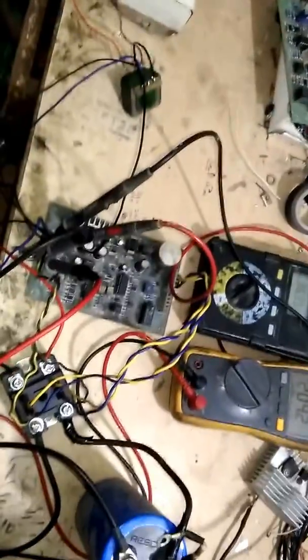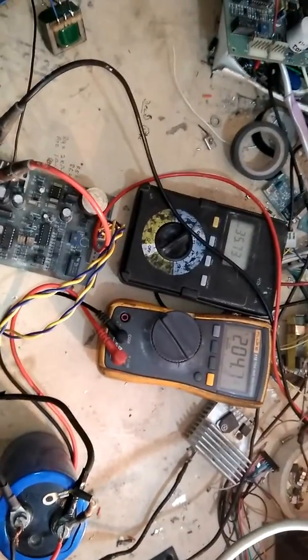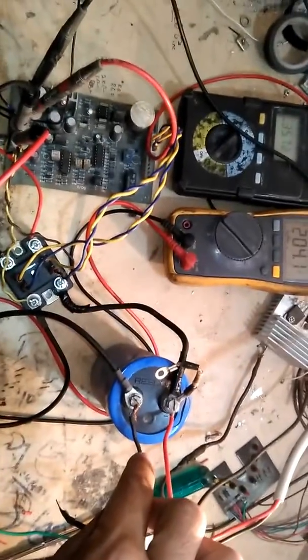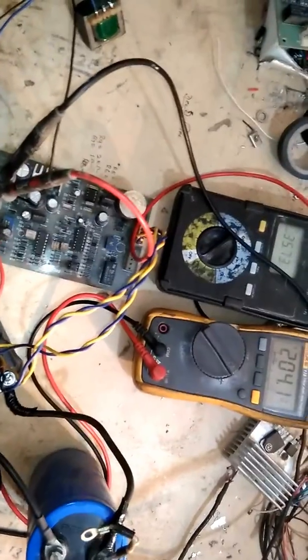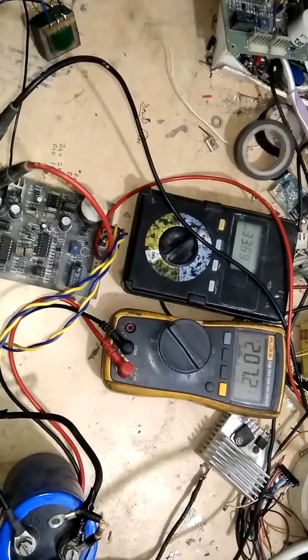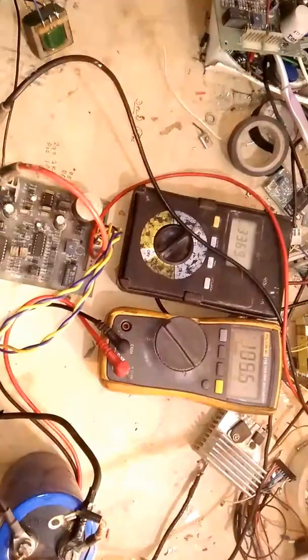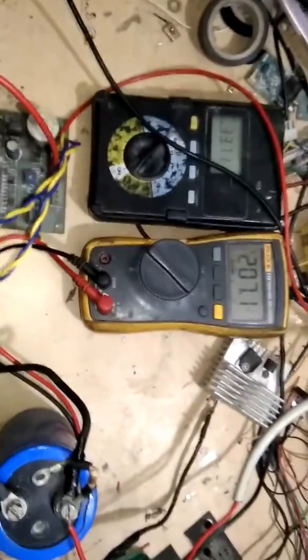Let me do one more test — I've connected a 200 watt bulb as a load. The voltage here is constant with the 200 watt load, so things are going very well. I'm being a bit careless here — please guys, use an experienced person with you and don't be careless. Sorry for this — I will rectify this in my next videos. The 270 volt spike you see is just what happens when I put a load on the capacitor and then remove it — it delivers stored energy and causes a small spike.